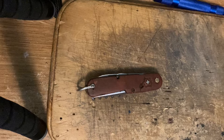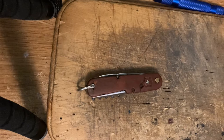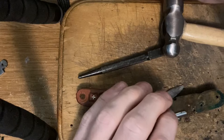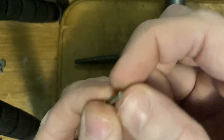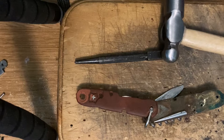The center punch isn't working, so I'll take care of this off camera and come back when it's done. I've got a 2.25-millimeter drill bit going through the tops of these rivets to get them out. The first pin turned out to not actually be a pin - it looks like it was actually a bolt that they ground the threads down on. What ended up happening was I tried to pull it out and the whole head ripped off the bolt, but that actually worked out - I just punched it out the other way and pulled it from the flared end.